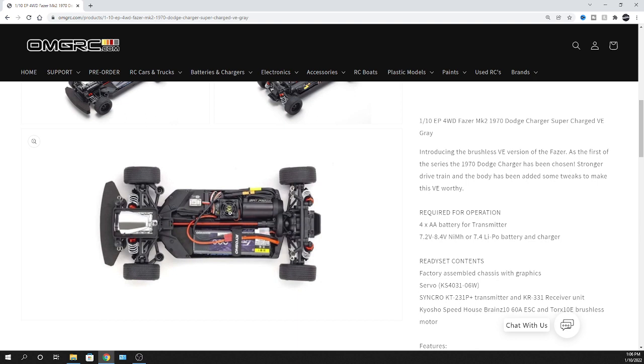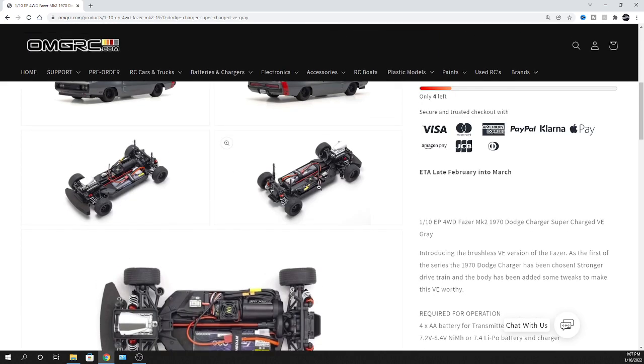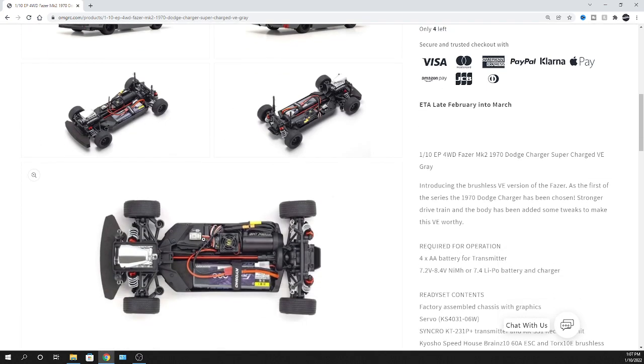It's kind of like saying the electronic speed controller box. Like, well, it's the electronic speed controller. It's weird how they did it that way. So I'm not sure if that was an oops, unless the picture doesn't show exactly that. In some cases, like the brushed one, they would have a cover over everything, which was not great because it just heated things up, and then you couldn't expose the heat sink for some air to flow over the fins.